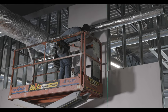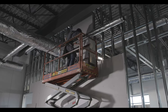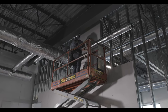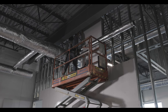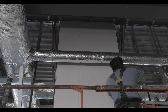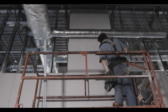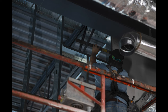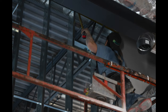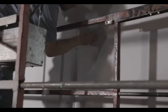When you're up doing your tops, screw the whole thing off — you don't want to go back to the same spot twice. I'm finding the easy piece first: the one with zero cuts. There's always one piece in the wall without any cuts — do that one first so you can get your side-to-side measurements for the other tops. I use a square — it's so much faster and cleaner. You can square across and up and down. I'm making a list and drawing a diagram of my cuts, and cutting right off the lift where accessible.